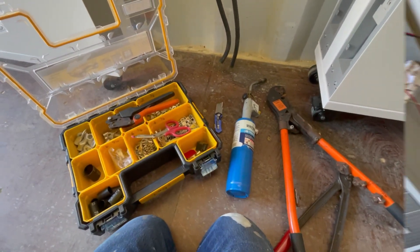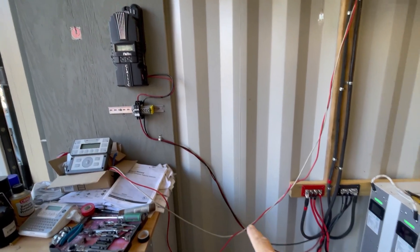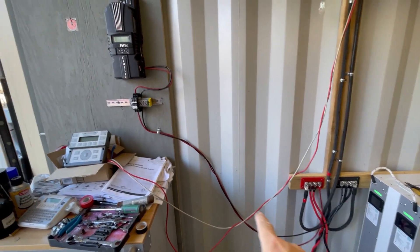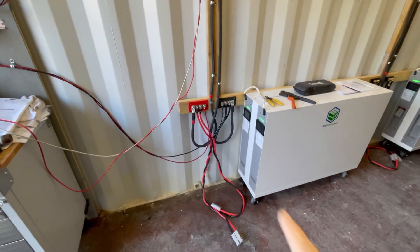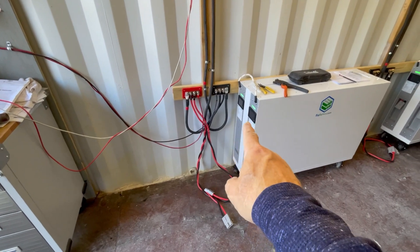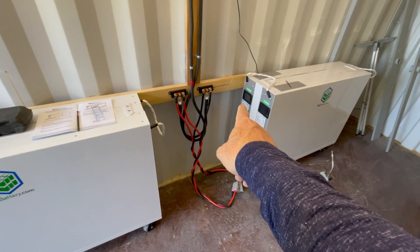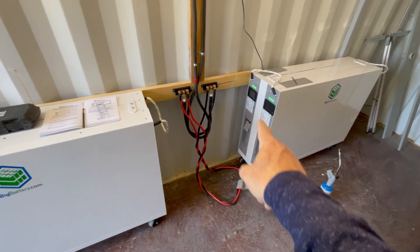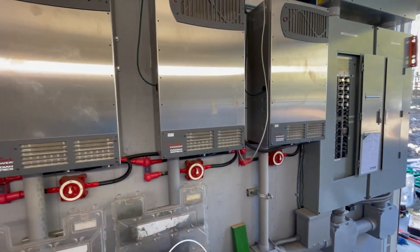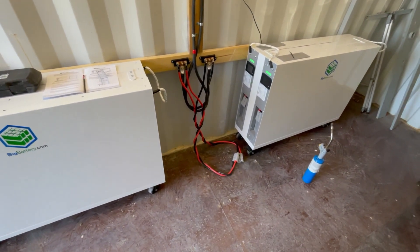Oddly enough there was a Classic charge controller with about 2,000 watts of power directly wired to the golf cart batteries, so I've temporarily added some overcurrent protection — this will all get cleaned up, but not today. I'm going to check all four battery voltages to make sure they're all the same — I believe this one was 52.1V. I'll wake up the displays, plug them all in, then activate the grid on the Outbacks to get battery charging started. Then that will be a wrap, plus about an hour of cleaning up.